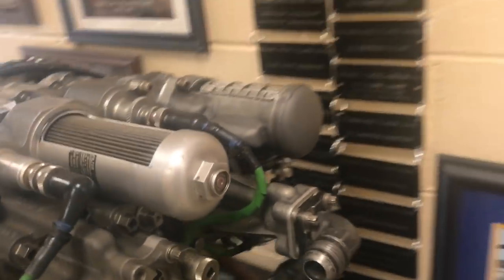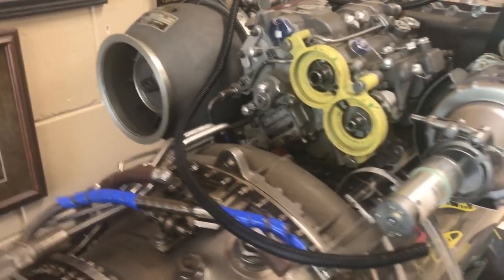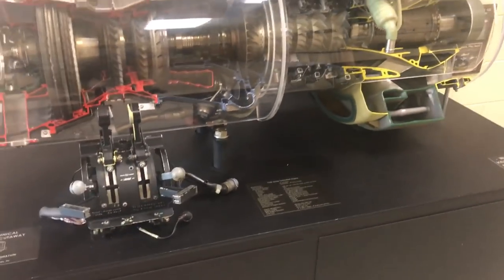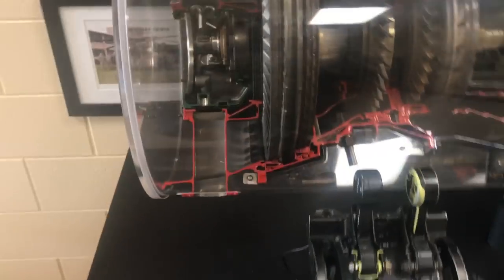Now parts and pieces. We've got a fuel filter — it's a liquid-to-liquid cooler that helps cool the oil and preheat the fuel. The starter, the HMU, pumps the fuel through the fuel nozzles — I think it pumps up to about 600-odd psi at a pretty high volume. We burn about 15 pounds a minute at cruise flight for a dual engine setup, about 900 pounds an hour.